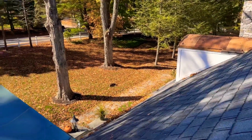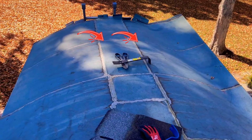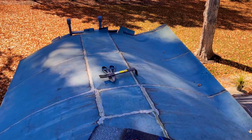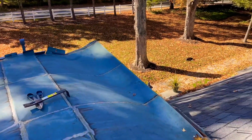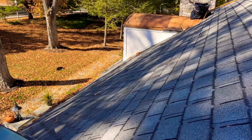Nice copper accents. The existing roofs, as you can see, are what's called a flat seam copper. All the seams are soldered together. Everything lays as flat as possible. What we're going to be installing is called a standing seam system, where there will be no exposed fasteners and everything will curve right over that barrel perfectly.